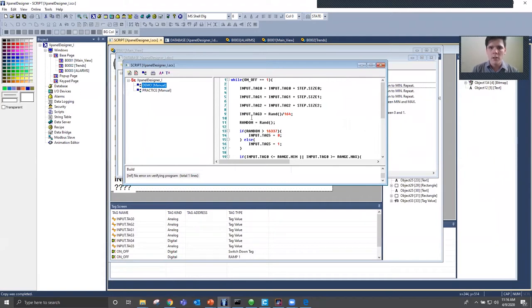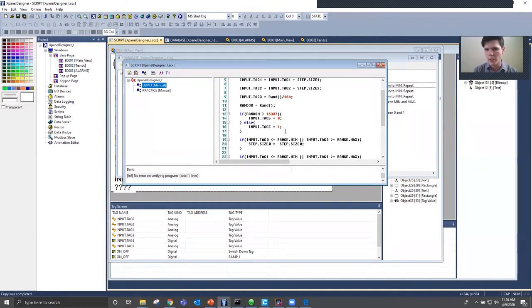I assigned one digital value to be random, but found a better approach: if the random value is above the halfway mark (16,000), it's a 0; if below, it's a 1. This uses if/else statements. However, the original method shows a decimal because it's doing division. I also changed the sleep to 1,000 milliseconds — so it's 1 second between cycles rather than 0.1 seconds.